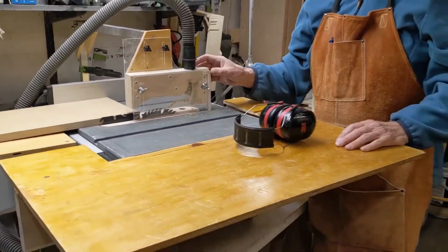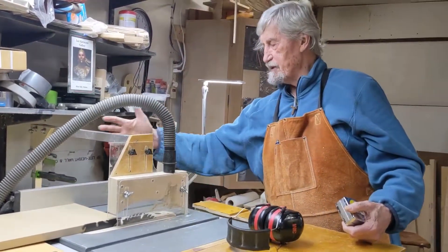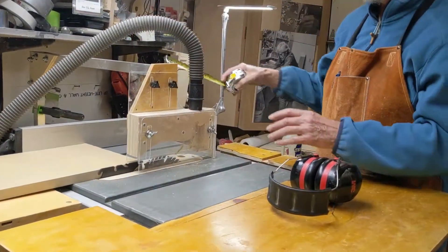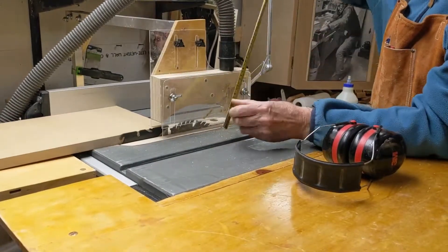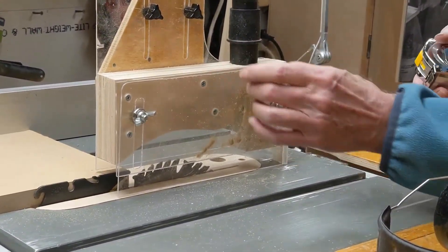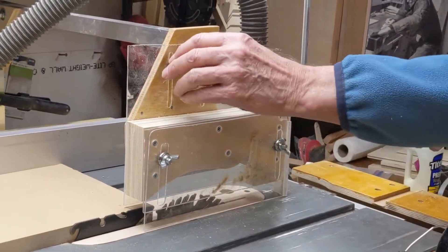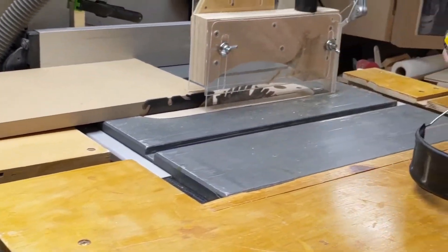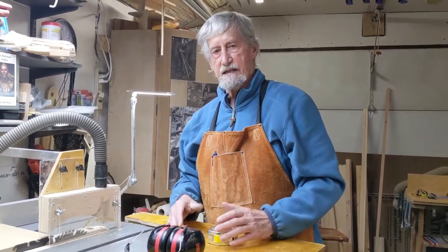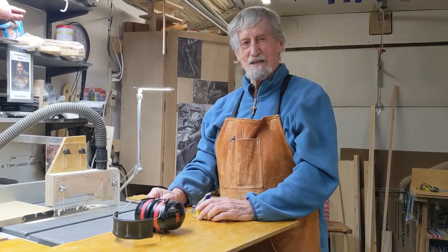I hope you enjoyed it. If you want any dimensions to the size of this thing, I can give you those. I've extended my table so that dimension may not be useful to you, but I've made it nine inches above the table — that's plenty of room. This is 11 inches long and about four and a quarter inches high. I've made it out of three pieces of half-inch Baltic birch plywood on the outside, and then just a bunch of nuts, wing nuts, and things like that connected to a shop vac. I hope you picked up some pointers. If you need more dimensions or anything more about this, please leave a comment and I'll get back to you as soon as I can. Thanks, and hope to see you in the next video. Bye-bye.